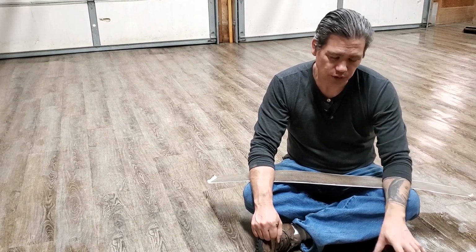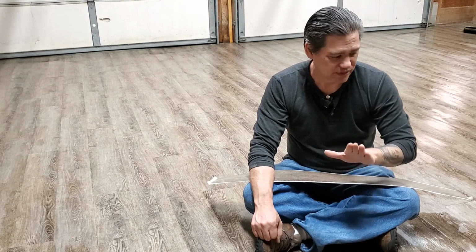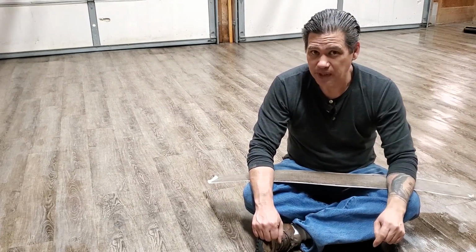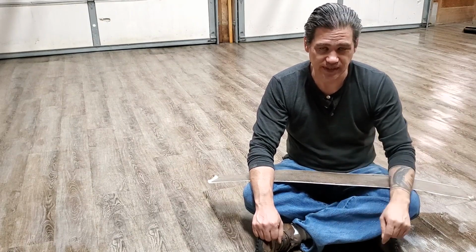If you are going to install this floor, make sure you prep your floor ahead of time. Make sure it's clean of dust, oils, or anything else, and that it is fully prepared before you install this flooring. That's where you're going to find the fails. If you find that you're going to have a problem area, throw down some contact cement ahead of time, so that way you get strong adhesion.